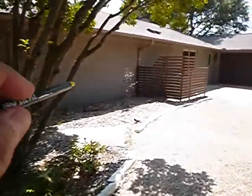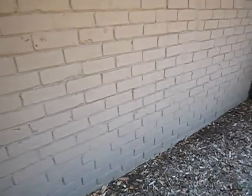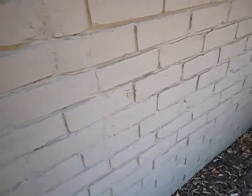High soil, negative drainage — repeated around the perimeter. Remember those weep holes over the front door? They're supposed to be around the foundation perimeter as well. Home ownership 101: all roofs leak, all walls leak — they're supposed to shed water faster than they accept it. Brick is porous. This brick used to be porous until they painted it, turning a low-maintenance wall system into a higher-maintenance one. With high soil above the foundation, water goes downhill — straight into your house.